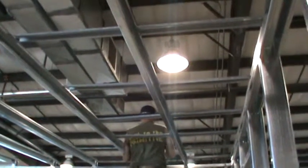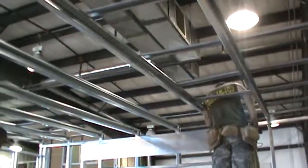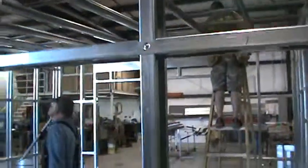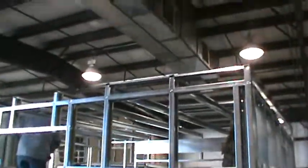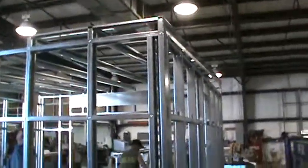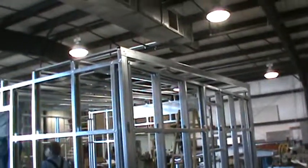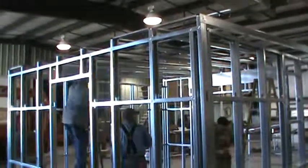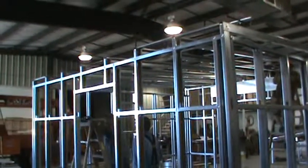See, the purlins are notched to fit between the rafters. This building has an 8-foot 4-inch low side wall. The wall that's facing me is the low side. It's 8 foot 4 inches tall, right there is 8 foot 4 inches. And then it tapers up on a half 12 pitch. We can make that pitch anything that you desire, half 12, 1/12, 2/12, all the way up to an 8/12 if necessary. Any penetrations, whether they're in the wall or the roof, can be framed in prior.